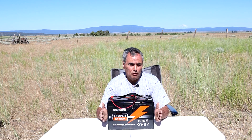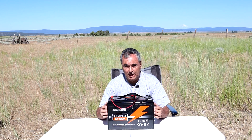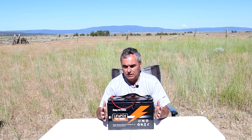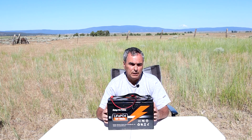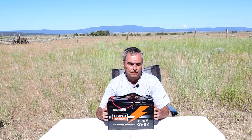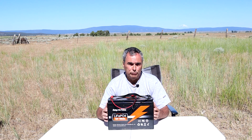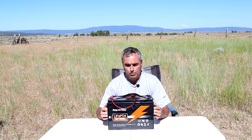Like all lithium batteries, this one has a battery management system — electronic circuitry that is the brains of pretty much every lithium battery. If you find a lithium battery that doesn't have a BMS, I would avoid it. The BMS is there to make sure the battery is operated safely and gets the longest life possible. It has disconnect protection for short circuits, overcharge, over-discharge, and over-current, protecting the cells inside.